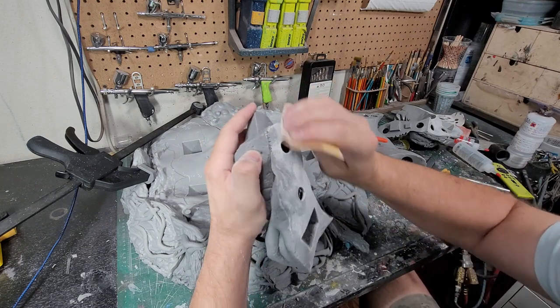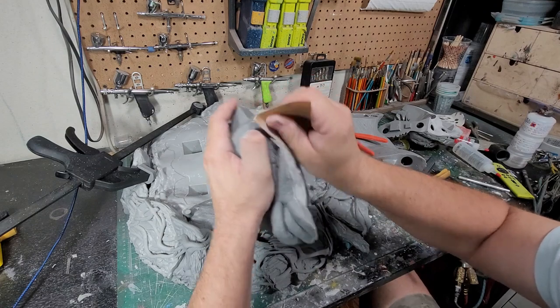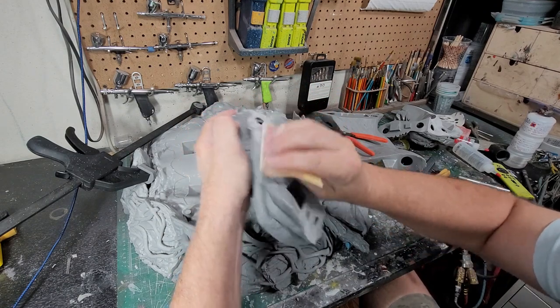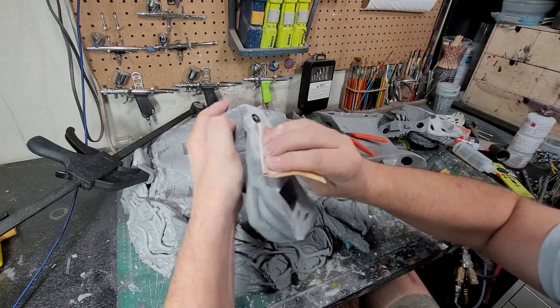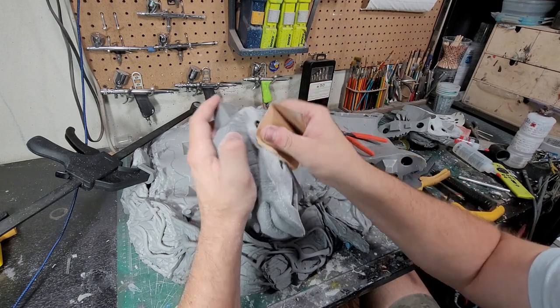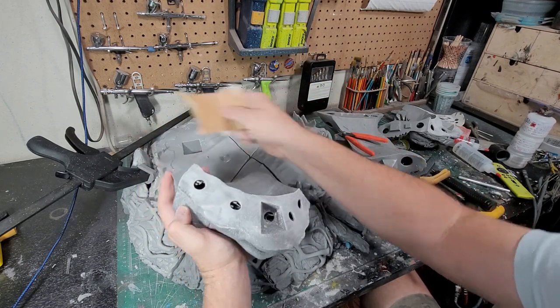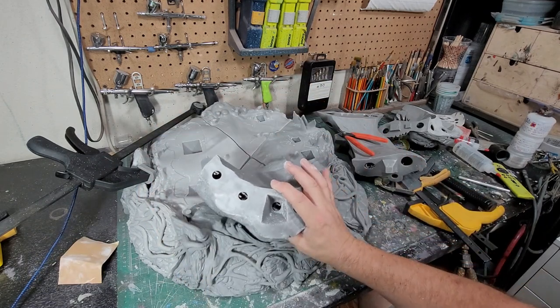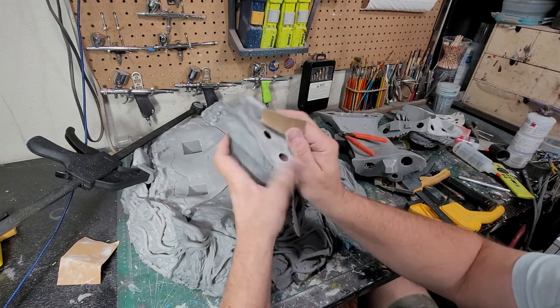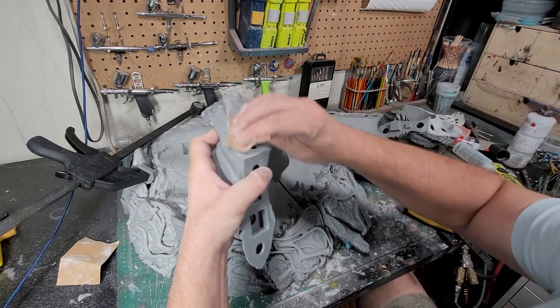The print settings are pretty good — the damage from the support marks is pretty low. I actually thought this was 180 grit but it's 240; let me grab some 180. I like 180 because it sands better for this type of stuff, it's just a little quicker.